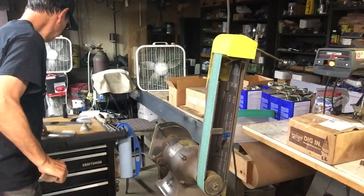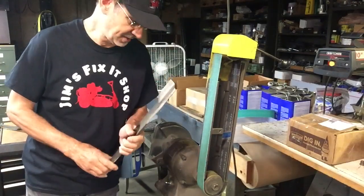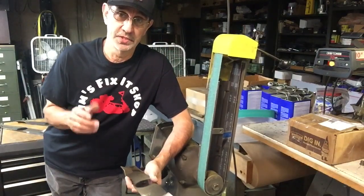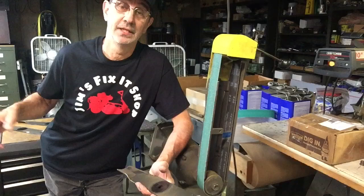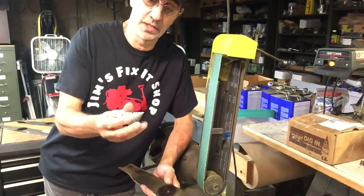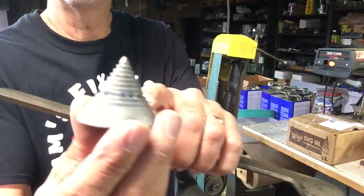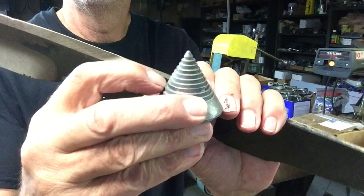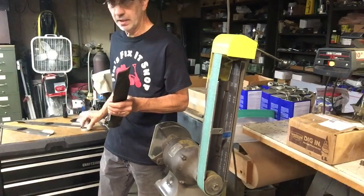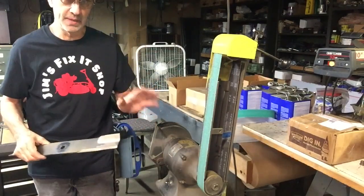I've got one done — this is a three-piece set and you want to balance them. These aren't quite so critical, but the snappers with the one big blade, you're going to want that balanced pretty good. If you buy one of these little cheap balancing fixtures, I had to machine this one — you can see it's real shiny. I had to machine that step down so it would fit on a snapper blade, because if you've got a sloppy hole it's really hard to try and center that to get the balance correct.